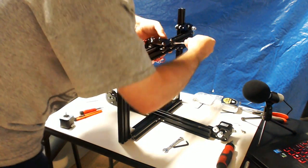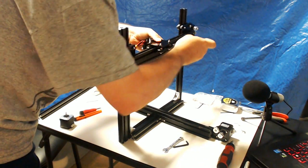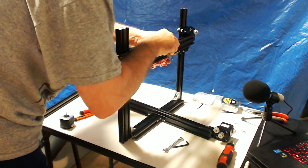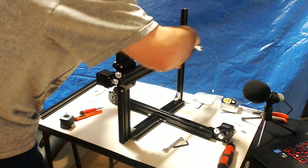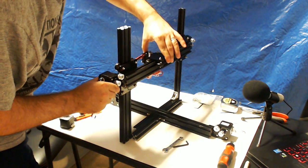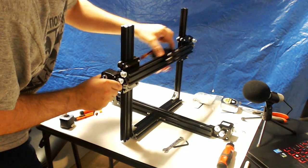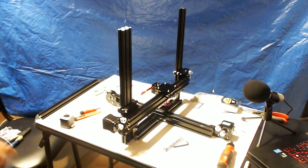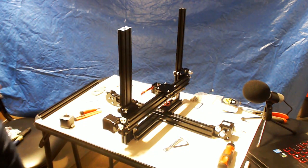It's a little high. Because what these eccentric nuts do is they actually move the bearing. You can see that is pretty good — there's no wobble in any direction and it spins super smooth. That was a fun time.